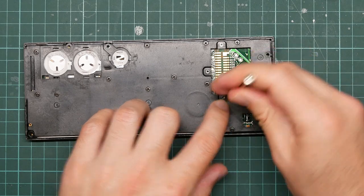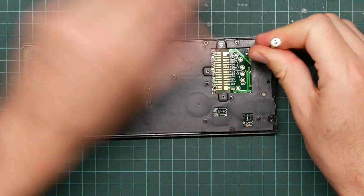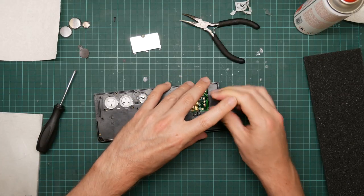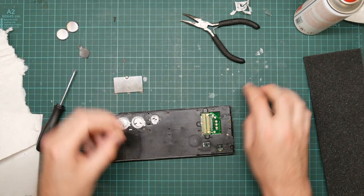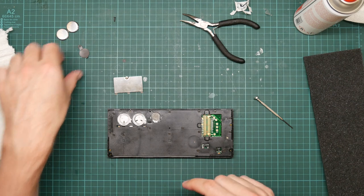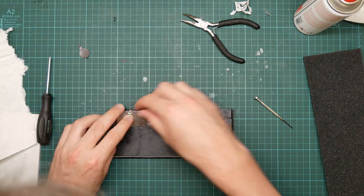If I can decode the ROM, then ideally this would then lead to reverse engineering the instruction set. That's getting pretty hard. But one possibility is to try and find an area of ROM that's unpopulated and then force the machine to jump to a location there. I could potentially, using a microcontroller connected to this interface, then simulate ROM and run my own machine code on it. I mean, this is not useful in any sense of the word, but it would be cool.